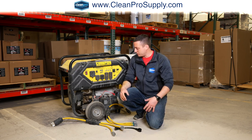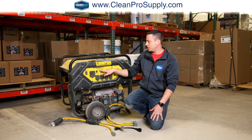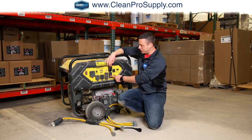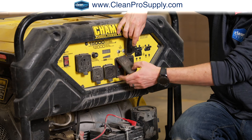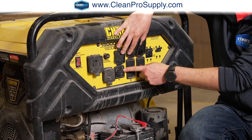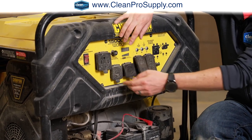So just to recap a little bit, you have volts times amps equals watts, and that's how you can measure your running watt capacity of your generator. This outlet, even though there's 2 plugs or 2 sockets, only use 1 because this is 1 circuit and you don't want to pop the circuit. So 1, 2, this is 120 volt with a 3-prong 30 amp. You can use that if you have the proper adapter, but you only use this for 1 appliance.